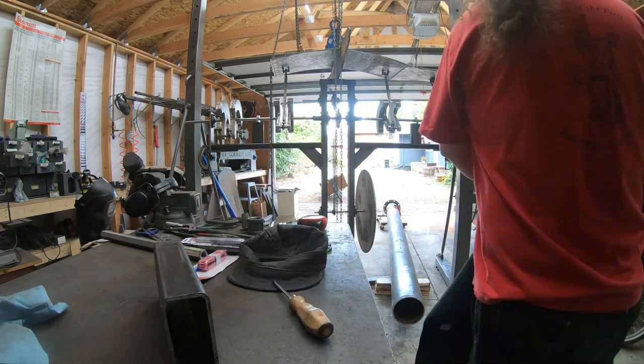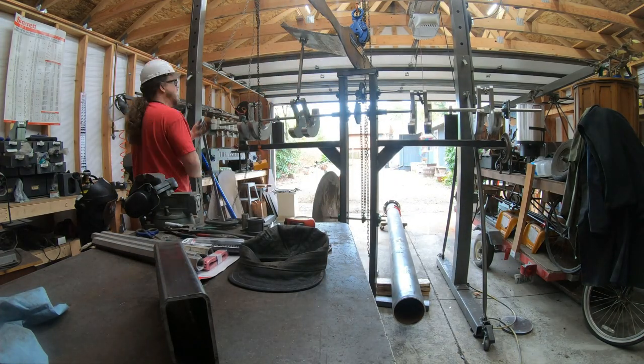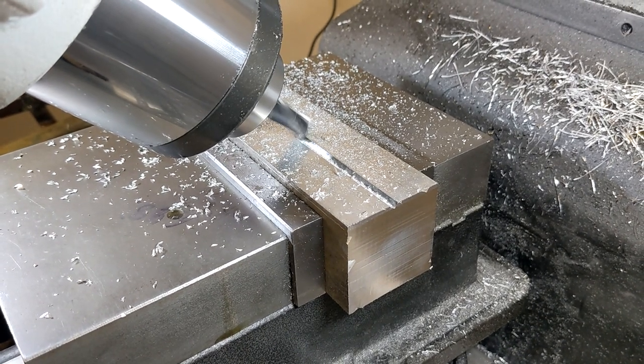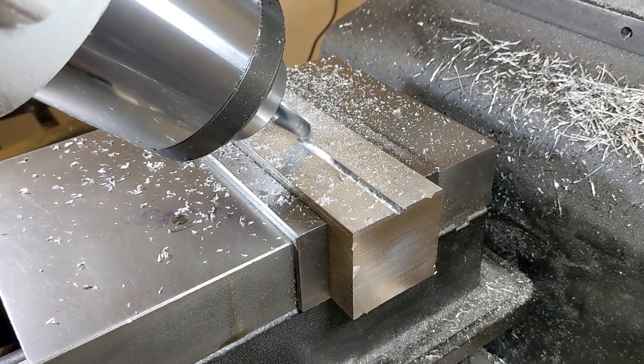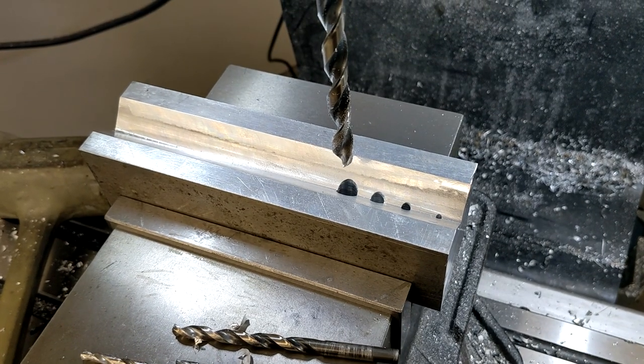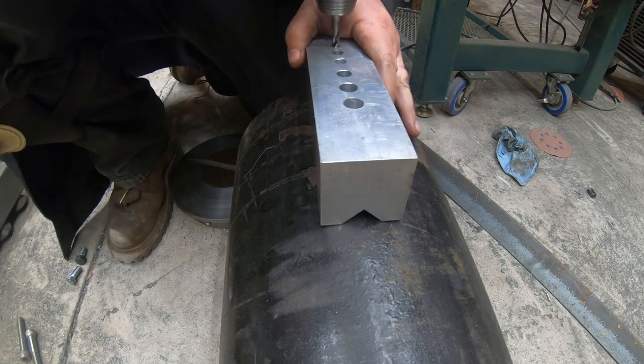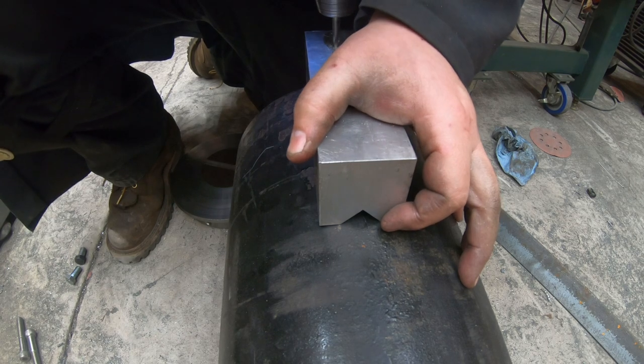All the last serious question marks had been dealt with. The test stand had done its job, so it was time to take everything down and make room for the final work. First, all the mounting holes had to be drilled and tapped in the post. Sadly, I've yet to find the radial arm drill press of my dreams, so this would have to be done manually — and the truth is, I'm really bad at drilling holes manually. I can just never keep them perpendicular. I spent an afternoon making a drill guide: just a chunk of aluminum with a V-groove down one side, and a series of conveniently sized holes drilled through the center of the groove. It was a bit marginal for the 8.6-inch OD of the post, but it worked — I'm happy to say that none of the mounting bolts screw in at an embarrassing angle.